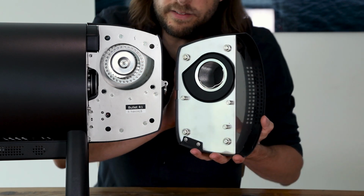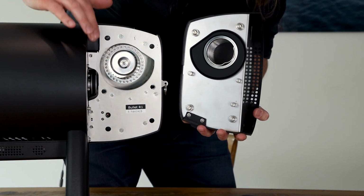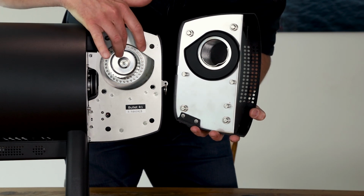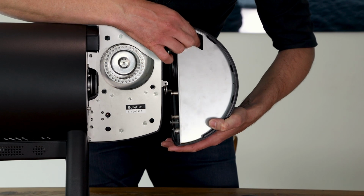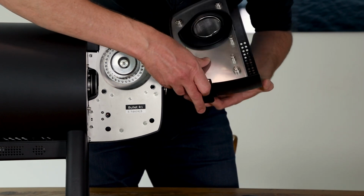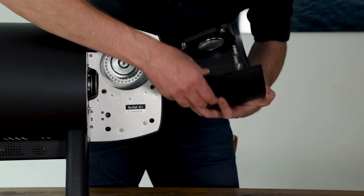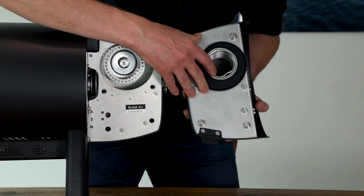If you have a look at the chaff collector or at this whole part of the roaster, then you see this outlet above here where the hot air is being sucked out of the roaster by this little vent here. It's being led through this hole in the chaff collector. So the chaffs are mainly within this chaff collector here, and you can take them out by opening it at the bottom, then shaking out all your chaffs and closing it again.